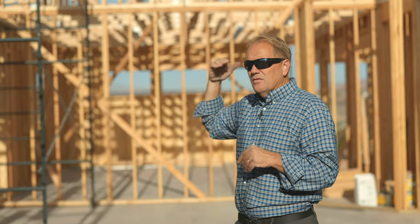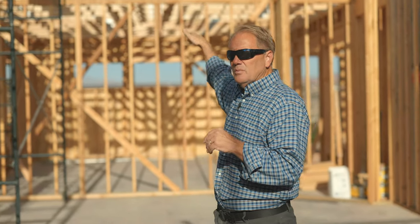There are a couple things I want to go through to help you prepare for trusses. One of the first things you want to be prepared for is any wall height changes. If there are any wall height changes in a build like you see here, that starts to increase the complexity of the trusses — how they sit, where the beams are, etc.